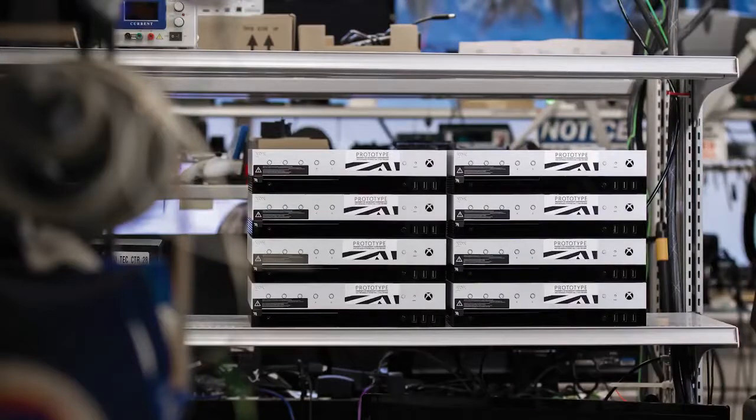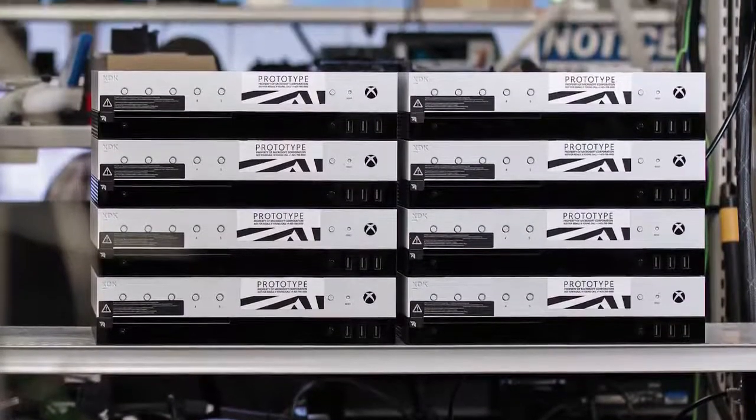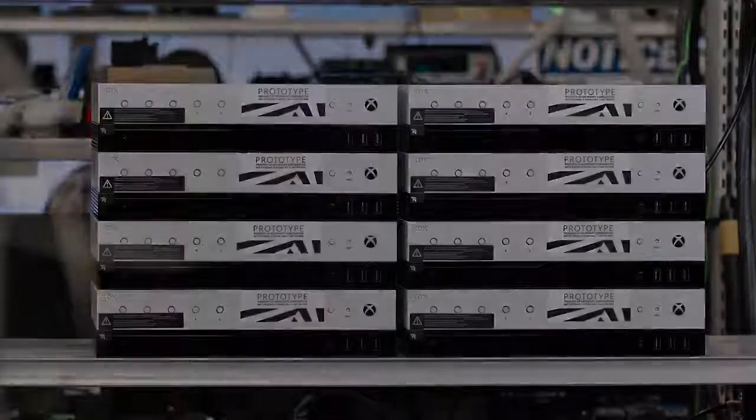One thing about these consoles is you can now stack them, and that may not sound like a big deal, but it actually is to developers. That was really hard for the hardware engineering team because in previous dev kits, the airflow and cooling was actually through the top, making it impossible for game developers to stack them — unless they created some kind of buffer between the dev kits, like a riser. I've even been to game studios where I've seen Legos in between two dev kits. So we changed the way the airflow comes in — it basically comes in the back and out the sides — and that allows the kits to be stacked 10 high.